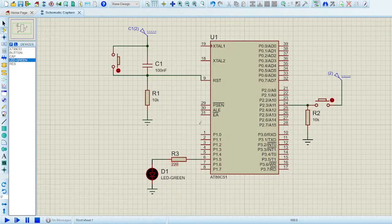So with the push button and with the reset circuit, you have to try different things, because obviously there's an RC constant circuit involved. So you have to look it up and do it yourself. Check whichever circuit works best for you. But in our case, let's reduce the value. The first value was, I think, much better, 1 nanofarad.